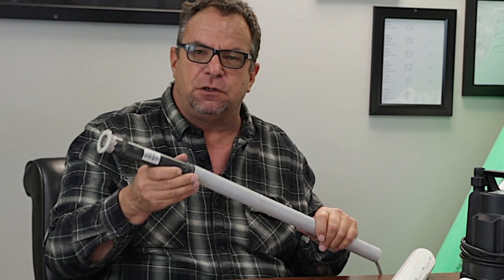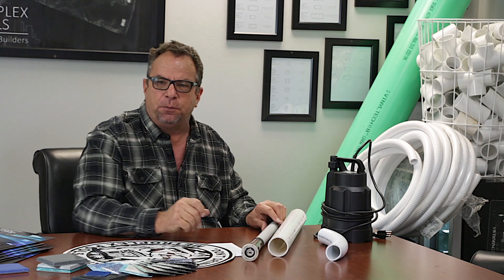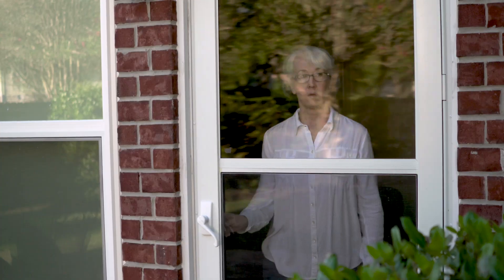The dirty trick in the business is to reduce the size of this pipe — put a half-inch pipe in there as long as the wire fits — and then your warranty guy comes out, yanks it out, calls you and says your builder inappropriately installed your lights. We don't want that. Two-inch rigid pipe and one-inch conduit for your lighting is very important. If you're not seeing this on your pool build, or your builder told you about it but when they get out there they're doing something totally different, you should make them aware of that.